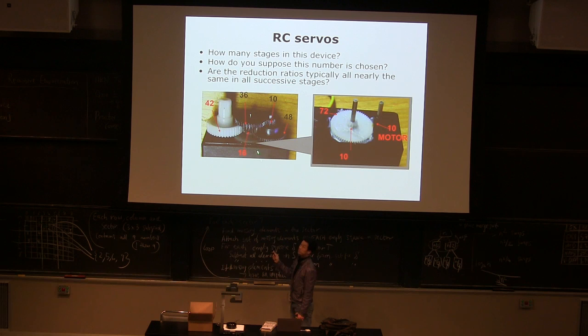That little tiny gear tooth takes all the forces. So a spur gear is compact and nice. You can make it very small, but it becomes really fragile because you're relying on one gear tooth. Imagine you're rotating really hard, like an impact force, and then that gear tooth is going to break, right? So that's why the planetary gear is designed. You can distribute forces among 4 gears in this case.